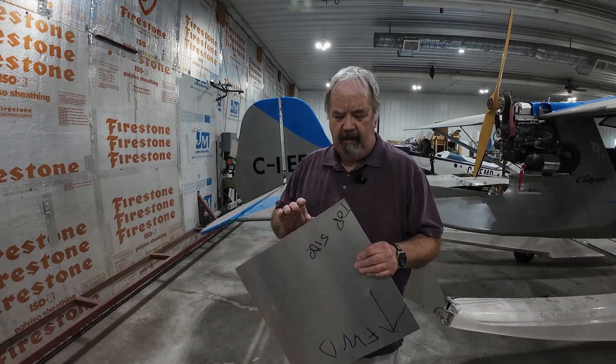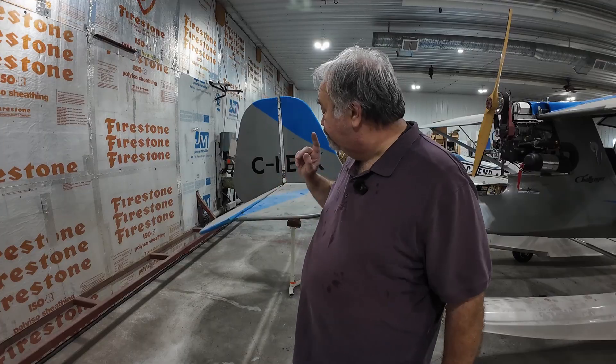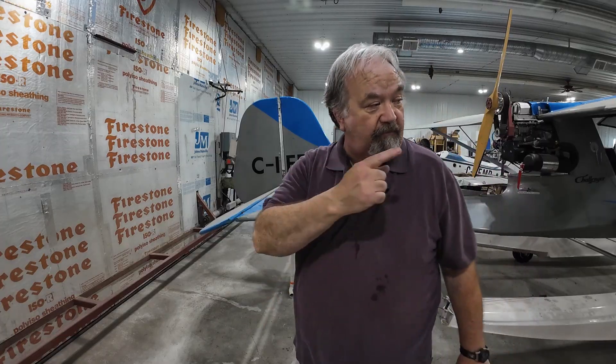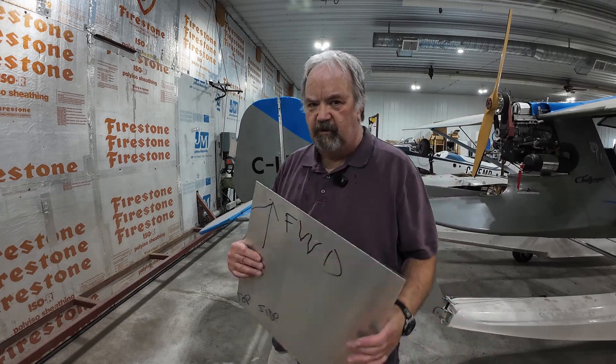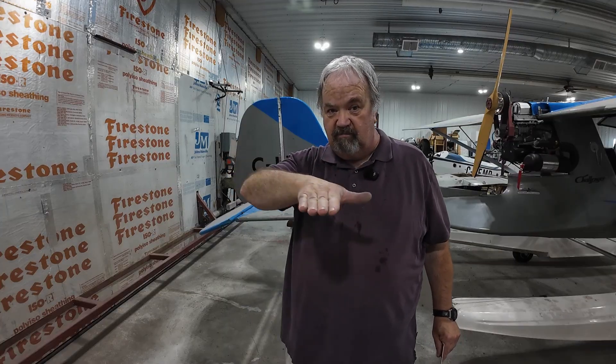It's aluminum — fairly thick aluminum, not quite one millimeter. For the first flight you saw last weekend where I was all over the place, it's because of this rudder — it's not big enough when you have doors on and floats. In the UK this tail had to be enlarged to be legal for sale there. I was very concerned during that flight — the tail was just swishing back and forth constantly, and no matter what I did this thing was wandering everywhere.